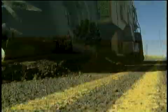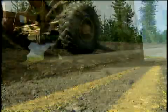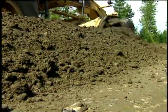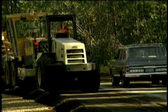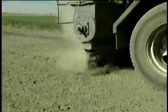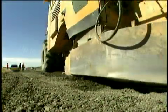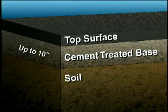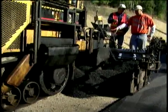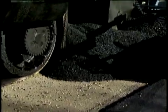Here's how it works. A pulverizer rips up the old asphalt and base. A grader brings the road back to the original grade, making it passable for temporary traffic. Next, a truck spreads a prescribed amount of cement over the pulverized road base. Hooked up to a water truck, the pulverizer mixes the cement, water and pulverized roadway down to a depth of 8 to 10 inches. The soil cement is compacted and topped with a riding surface, usually a chip seal or a hot mix asphalt.